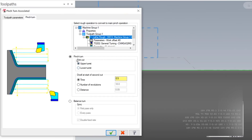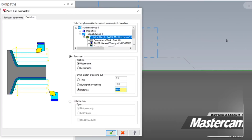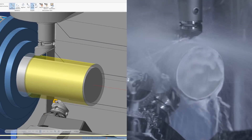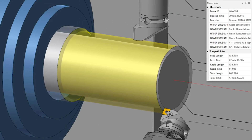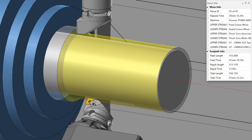So for this, I can do pinch turning where it is running at the same time, but one turret's going to be off a little bit in Z. I'm going to program a rough pass, and then the other turret is going to run that same rough path coming in an eighth of an inch off in Z. That's going to split the roughing pass between the two when I hit the pinch turning command. It's going to alternate the depths between the two tools — one pass is going to go in and cut off 50 thousandths of material — so 50 thousandths per wall, 100 thousandths diameter.